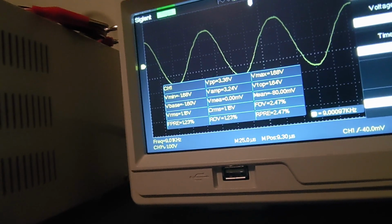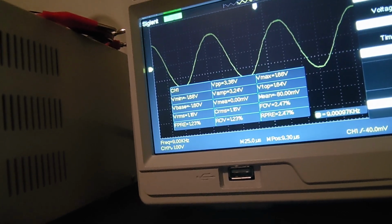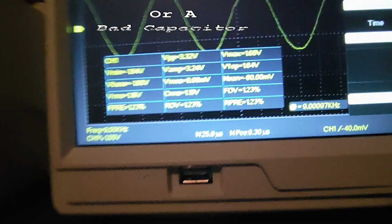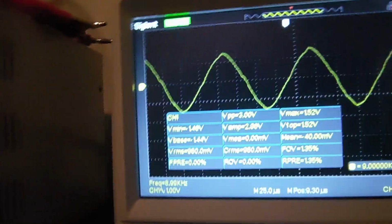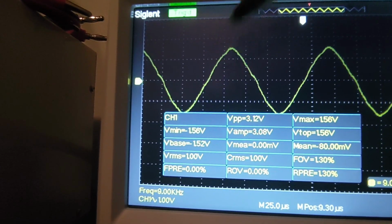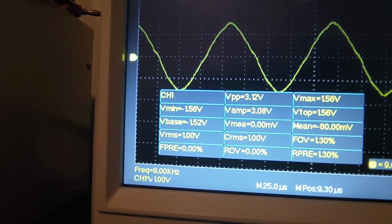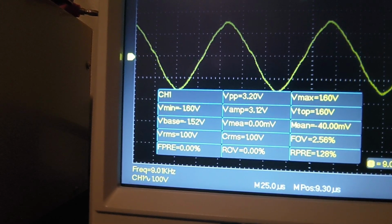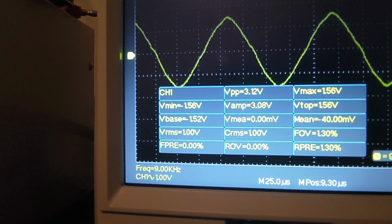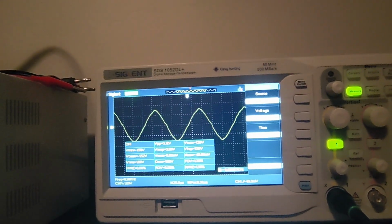So definitely issues in the amplification circuitry. Could be the potentiometer as well, but with that clipping, I would expect a potentiometer to create these types of issues if they're dirty, if you don't have that nice pretty bell curve. But clipping comes from some bad ICs or transistors or whatever's used to amplify that signal. So that's where that's at.